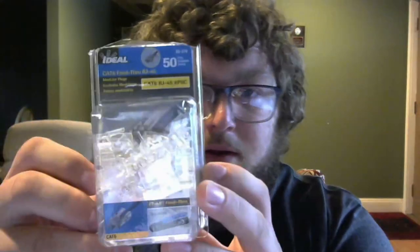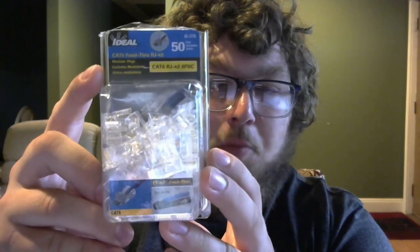If it's your first time making cable, I'd cut a little practice stretch first, because it'll probably take a couple of tries to get it right. You need a few things: wire crimpers, a roll of cable, and RJ45 terminators. I have Cat6 ones, but if you're making Cat5 cable get Cat5 ones. They also make pass-through terminators where you feed the cable all the way through, and when you crimp it cuts the extra ends off — it's super simple and makes it a lot easier.